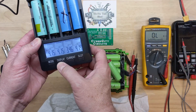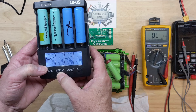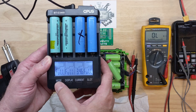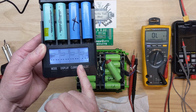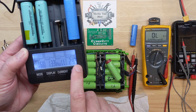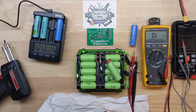Using this Opus BTC3400 intelligent tester we're going to test out these cells, and I already have two of each kind in here for testing. During the test I could already put an X on one of them — it has taken way longer than any others and still isn't at full potential, so I already know that battery has issues. The one on the right isn't looking too great either. They're all at about 4.14 volts and fully charged. Now I'm doing the quick test for internal resistance. That third cell has the highest internal resistance I've ever seen — it's definitely ready for the recycling bin. The others are all below 250 milliohms, which is good for used cells. These cells are not going to be for battery packs — they have enough age on them that I'm just going to use these for flashlights.